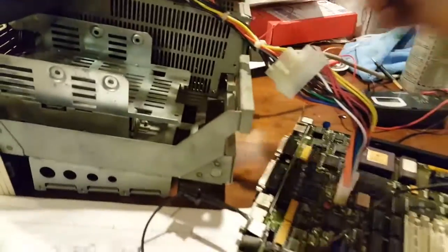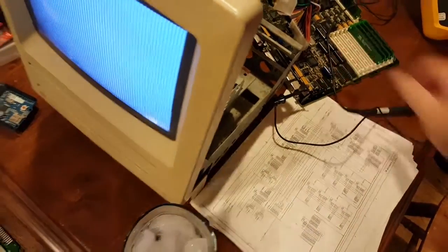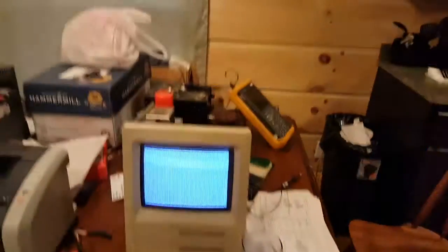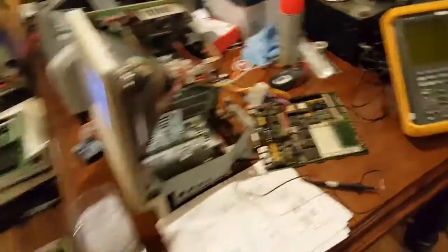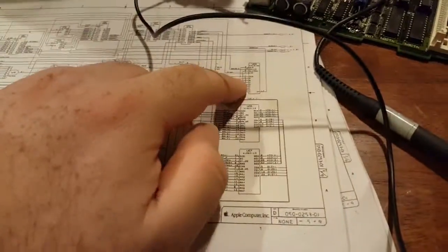This board — I've been working on a range of Macintosh SE30 boards. I'll turn the power on so you can see what I'm talking about. The problem is there's a stripe in every so many lines. Now, the majority of the time, technicians that work on the SE30 automatically know that this chip right here, the LS166, otherwise known as UE8, goes bad. Most of the time it does, and that's the first thing I assume. So I went ahead and replaced it, but it made no difference whatsoever.